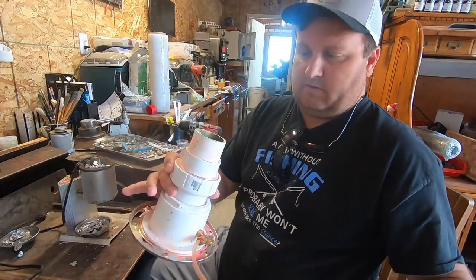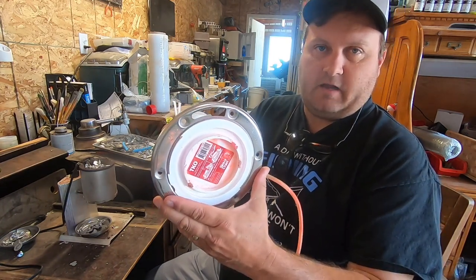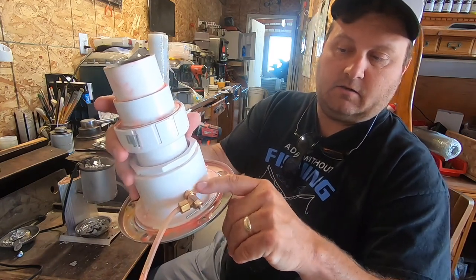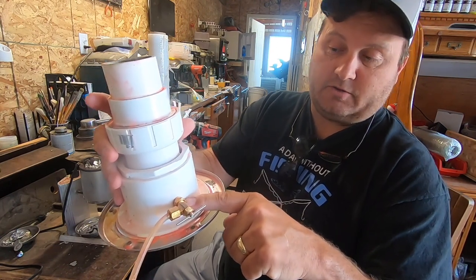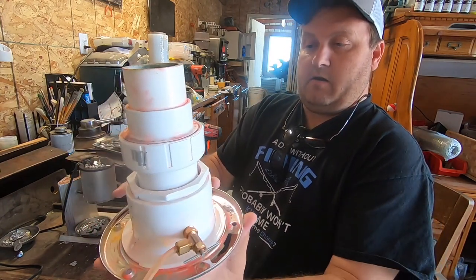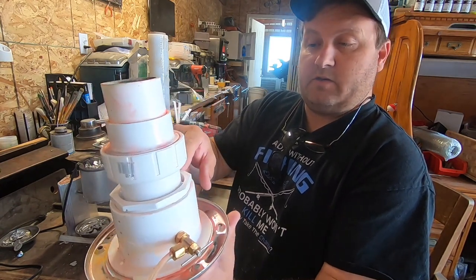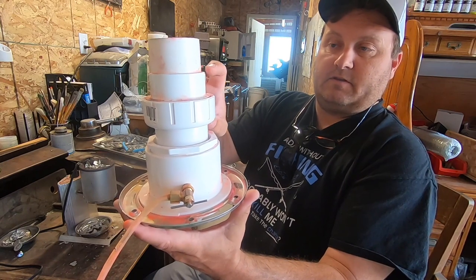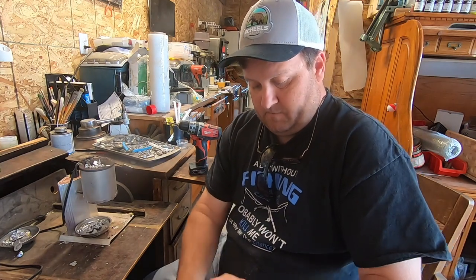For doing my jigs, I just built this little fluid bed. I've used a three-inch closet flange for a toilet. I tapped — looks like three-eighths threads in there — and then I've got a three-eighths by quarter bushing, then a needle valve, and from there a three-inch by two-inch bushing, then a little nipple. On top of that I put this union and another short nipple of pipe.